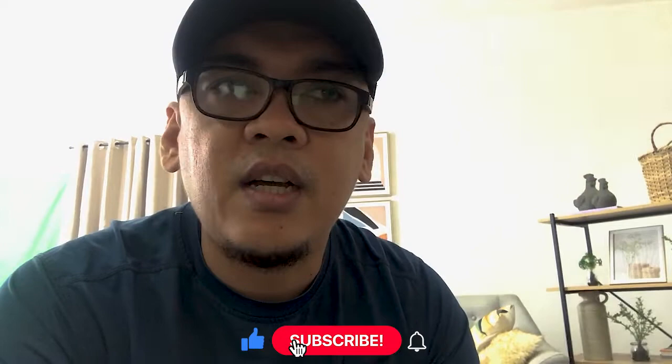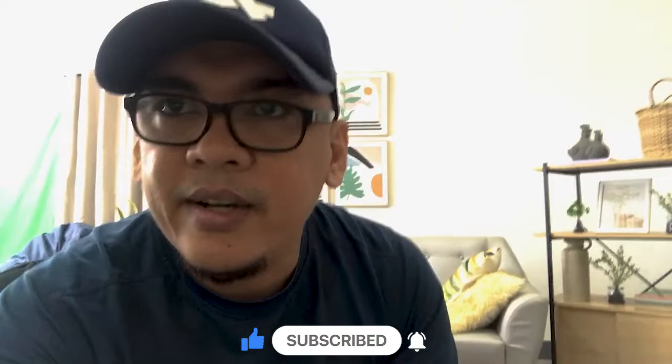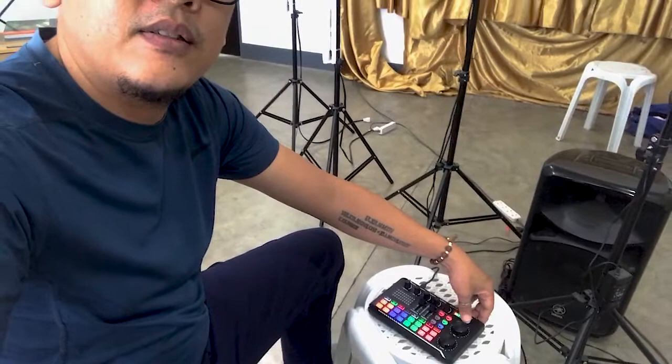So to give you a look at what I did — okay, so I set it up, and it's now powered. By the way guys, when I unboxed the sound card, it only comes with one data cable. According to the manual, it's a Type-C cable. So you need another Type-C cable. If you're going to connect the sound card to the computer, one Type-C cable connects to the USB, and then you need another Type-C for power. So I'm going to power it down and back up so you can see.